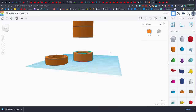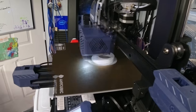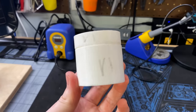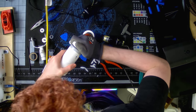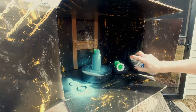A few hours of designing in Tinkercad — I'm learning from scratch — getting some cylinders designed and printed. Hours upon hours of printing, and it wound up taking about four revisions to get to a first draft I was excited with. Everything fit perfectly, other than I needed a smaller ring that screwed onto the microphone and a wider ring that housed the capsule, and I was going to have to superglue those two parts. I was stoked. My idea was to splatter-paint it — since I have a kind of 90s colorful glitchy vibe, splatter paint is basically the glitch of painting.